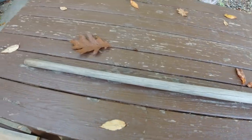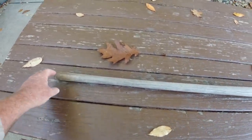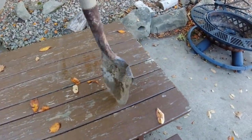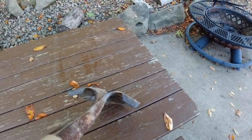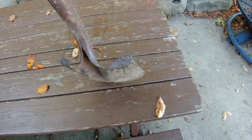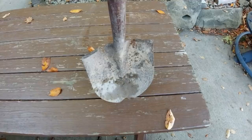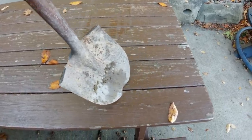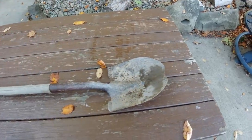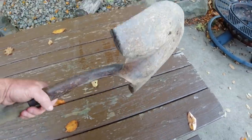As many of you know, I was a blaster for years, probably 25 years. I blew things up for a living. You drilled holes and you would stem those holes, so the holes would have cuttings all around them. The hole size would range anywhere from 3.5 inches all the way up to 7 7/8 inch diameter, most of them being anywhere from 5.5 to 6 3/4. So around the hole, you'd have a big pile of cuttings and you'd have to shovel them back in the hole after they were loaded. So we used shovels a lot.